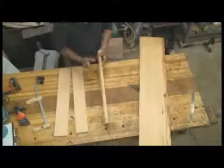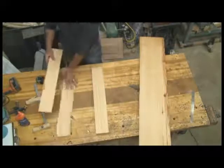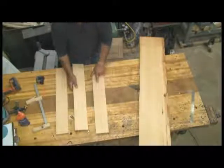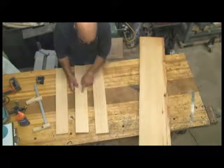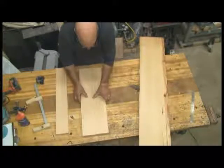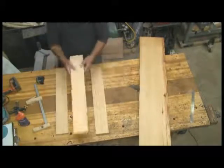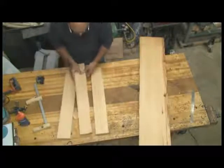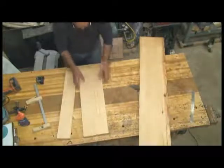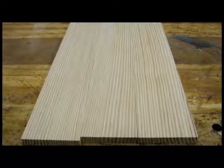This is the best side — that's the nice face side. I'll come along now and look and say, what do we got here? What have we got to deal with? This board has got wider grain in it. This board has got narrow grain and wide grain. So what I want to do is take the wider grain in here and match it up with this. Now it's starting to look not half bad. What about this other board? This board's grain is a lot wider than this. So if I take these two pieces of material and put them together, then I'm starting to get what looks like one solid board.